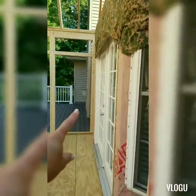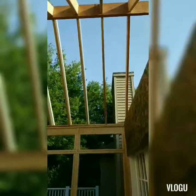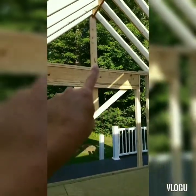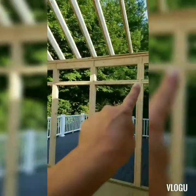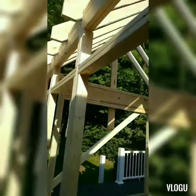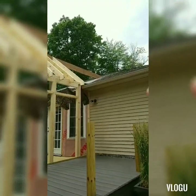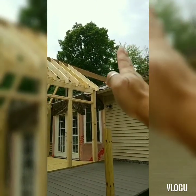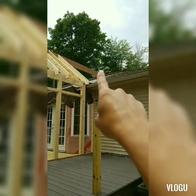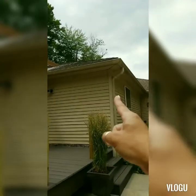All this is getting ripped out. We're going to have a four-panel door here, another four-panel door there, and then the triangle windows, the transoms, the floor, and the four windows — they'll be eight inches on the ground over here as well. After he builds the little trusses up there, that's where the metal roof comes in and they valley the metal roof in, and then they shingle onto the metal roof so there's a valley that comes to this eave so it drains.